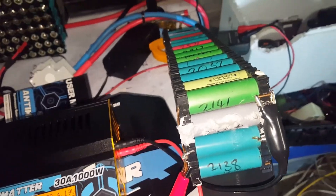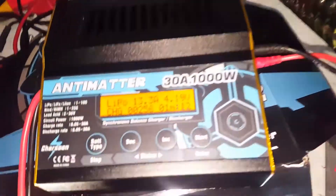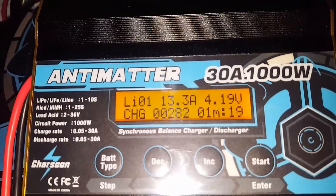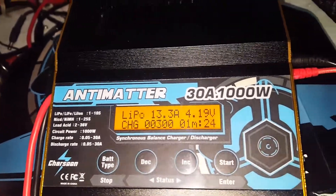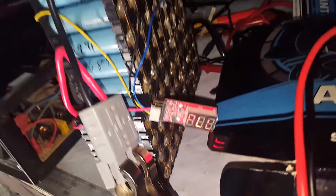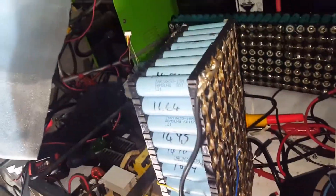Here we are doing some lithium charging on a 1S 60P battery — pushing 13.3 amps at just under 4.2 volts, so just under fully charged, sitting in constant charge mode. The power supply's doing a good job. Can't see it because of the backlight but it's still 11.8 volts. Hell of a battery pack that.